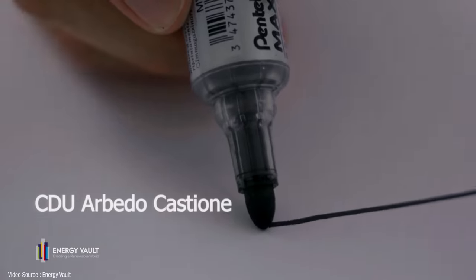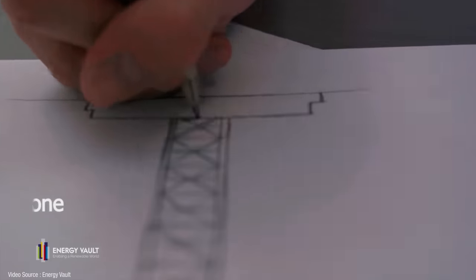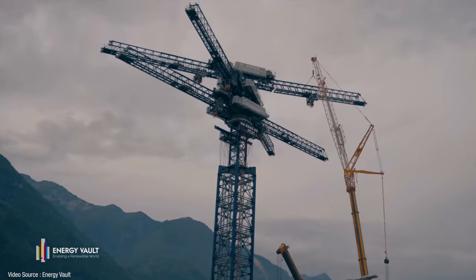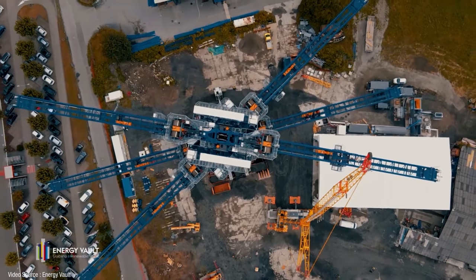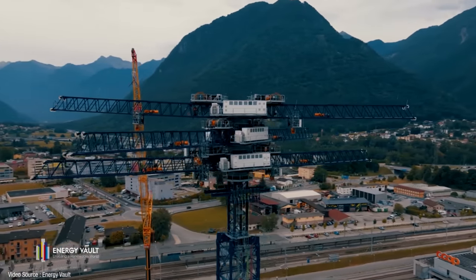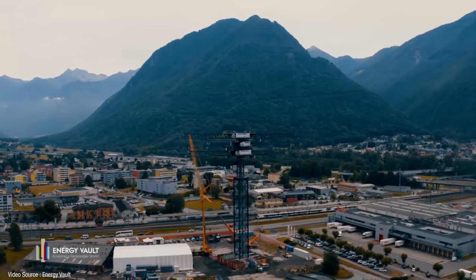The company developed their system in Switzerland and built their first full-scale commercial demonstration unit on the outskirts of a town called Arbedo-Castione in 2020. They claim a standard configuration can provide 35 megawatt hours of power to the grid. Picconi reckons the system can go from zero to four megawatts in just 2.9 seconds and provide instant response within milliseconds, meaning it rivals lithium-ion batteries as a frequency response grid balancer. It can also be used as a black start service — bringing a grid system back online in the event of a blackout — or run more slowly to provide up to 10 hours of continuous baseload discharge.